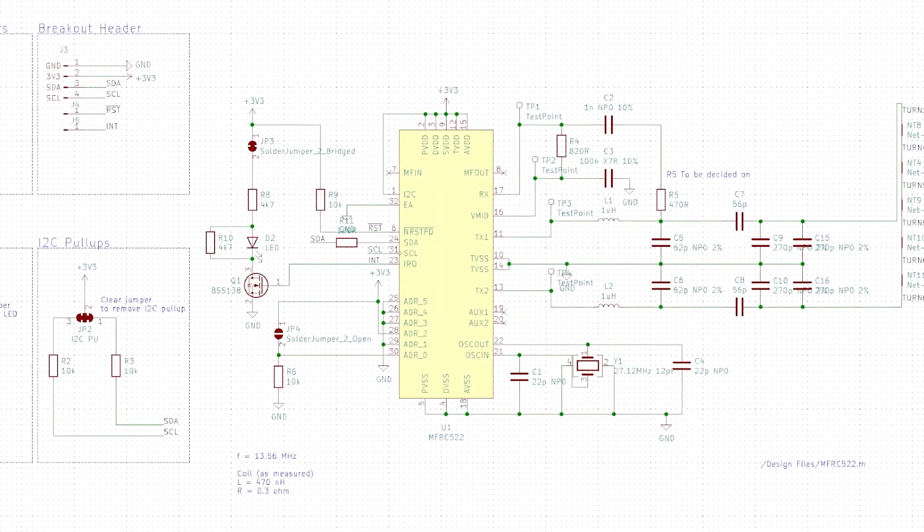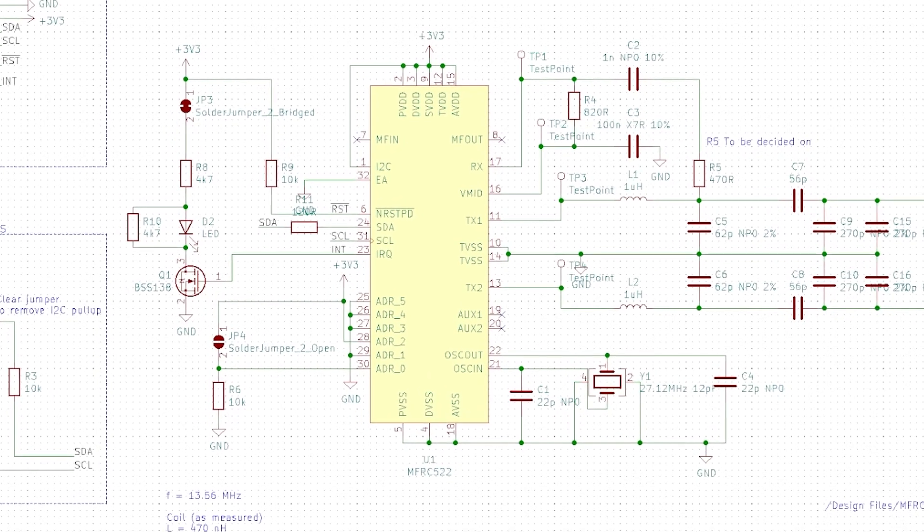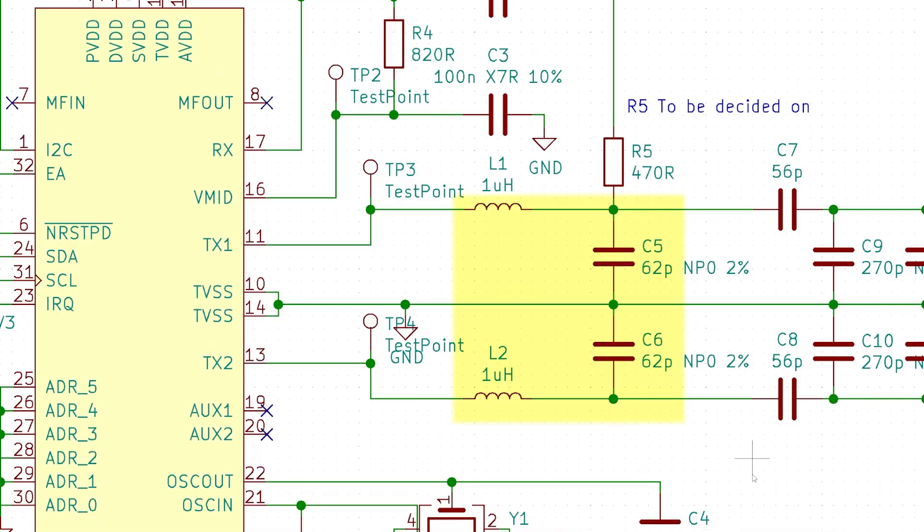This thing actually has to turn on. That's right — it's got to be able to run digital logic. So the driver IC chip outputs its power via an inbuilt H-bridge, and that's a very digital type of circuit. There are going to be lots of harmonics coming out of that. It's rough — it's just on or off, just pushing and pulling at this coil. And the first thing we need to do in order to suppress the electromagnetic interference is to put a low-pass filter in.